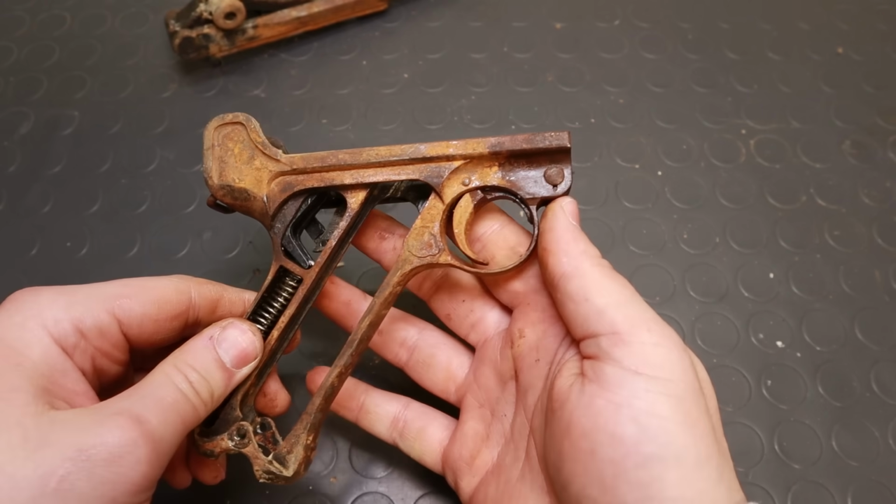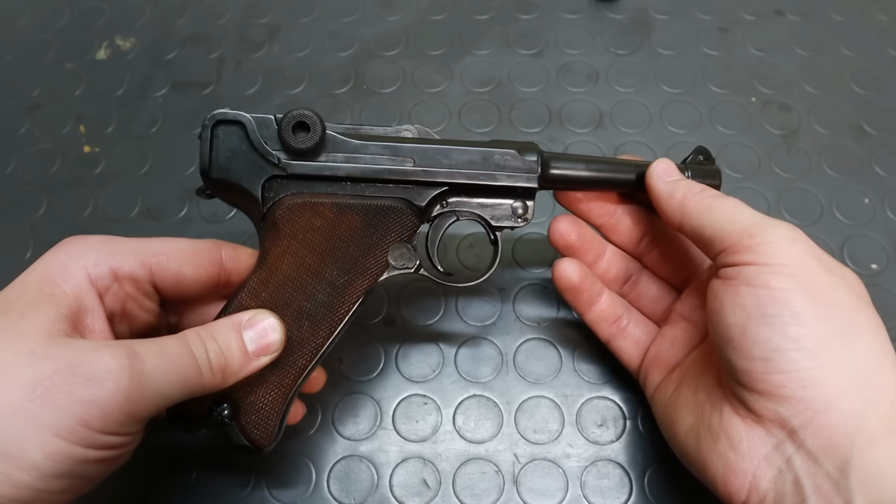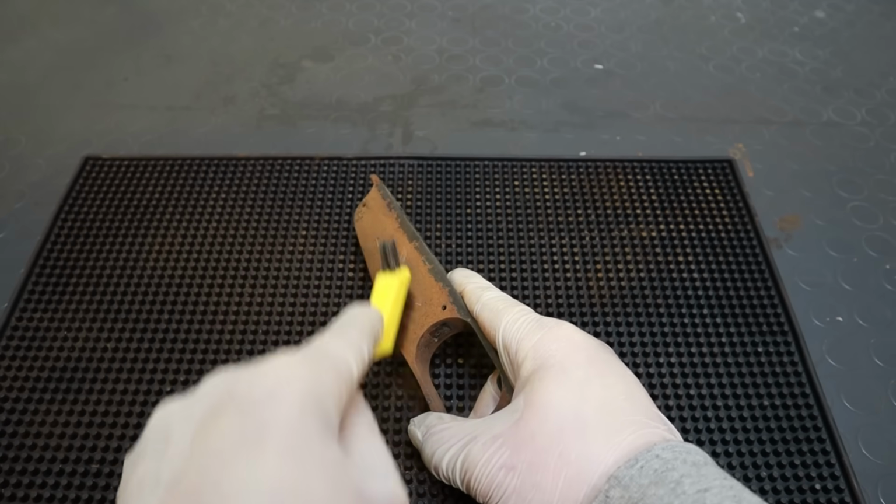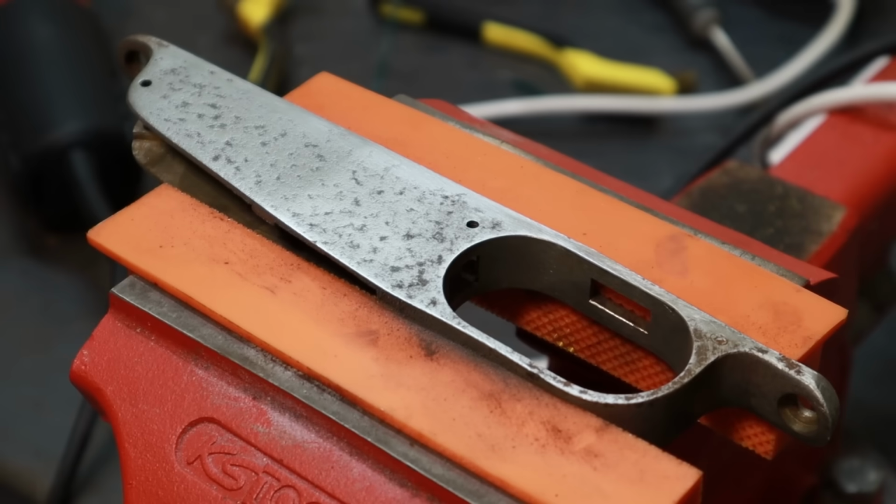Another way to spot the use of fake rust is to look at the condition of the metal surface once it is cleaned. If all the material that was on top of it is made up of corrosion products, there must be a proportional amount of metal missing. For example, rusting on this part was very superficial, so it's okay to find a relatively smooth surface underneath. Finding a smooth surface under this one would instead be incompatible with the amount of corrosion product.